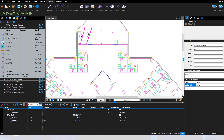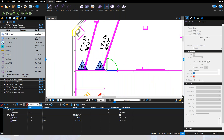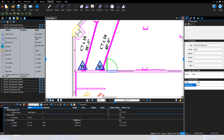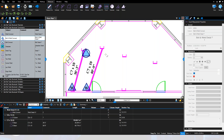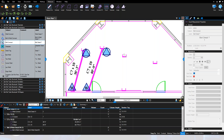We also have a full series of pallets for different connections. I can come in and identify specific connections — for weld connections, I can call out a weld here and a weld here, referring them to a specific weld detail. If this is weld type A-1, I can see I've got two weld type A-1s. For bolt-and-weld connections, I've got different symbols that come in as a group set so I can label all of one type at once.